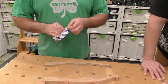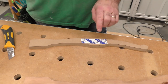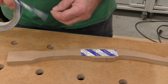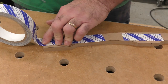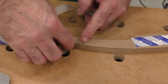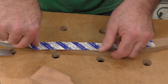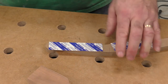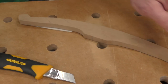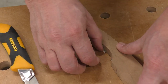I love this double-stick tape — I'm going to use quite a bit of it because I don't want it to move. The key to this, as you'll see, is the removal afterwards, because you don't want to break this template — it can be quite fragile. I'll stick another piece down in here, and I'm not worried about it overlapping because I will trim it. Now see this horn right here — that is going to be end grain, so you've got to be very, very cautious. I'm going to take it just like this, bring it in, and cut it right here because I want it fully supported around the bed. I'm going to come in and trim that overlap. I love these knives — I can press it right up against there and cut right down.